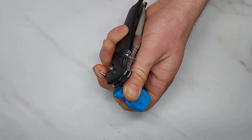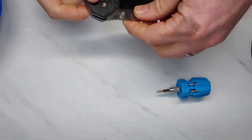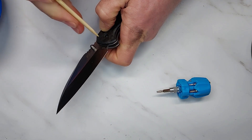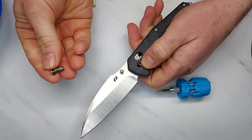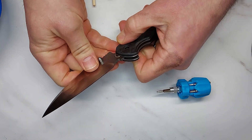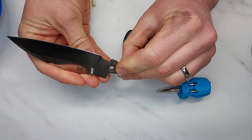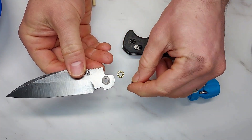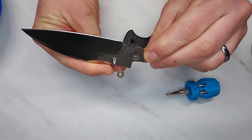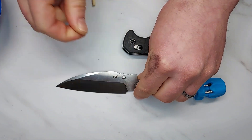There's the bolt. I was able to push the pivot out — there's a bolt on both sides, it's not a single-piece bolt. The blade slides right out. They've recessed the bearings into the blade rather than the handle, which means there's not a lot of metal where the blade goes on — that's pretty thin for a blade this long with that much leverage.